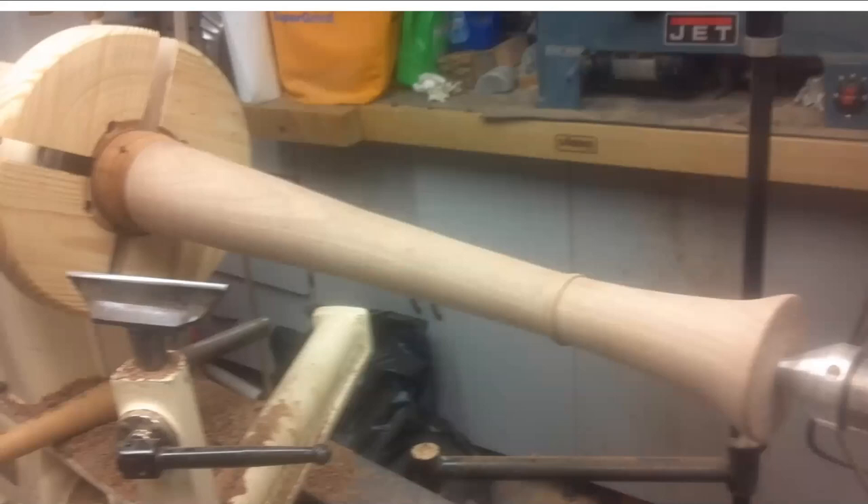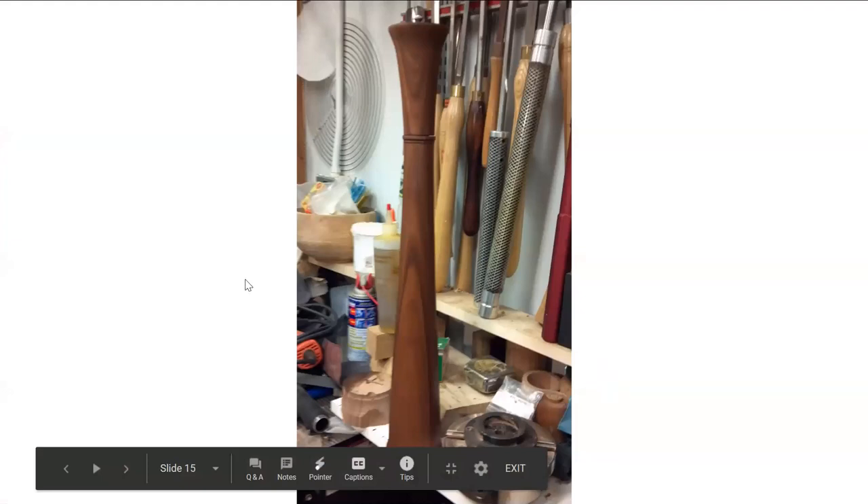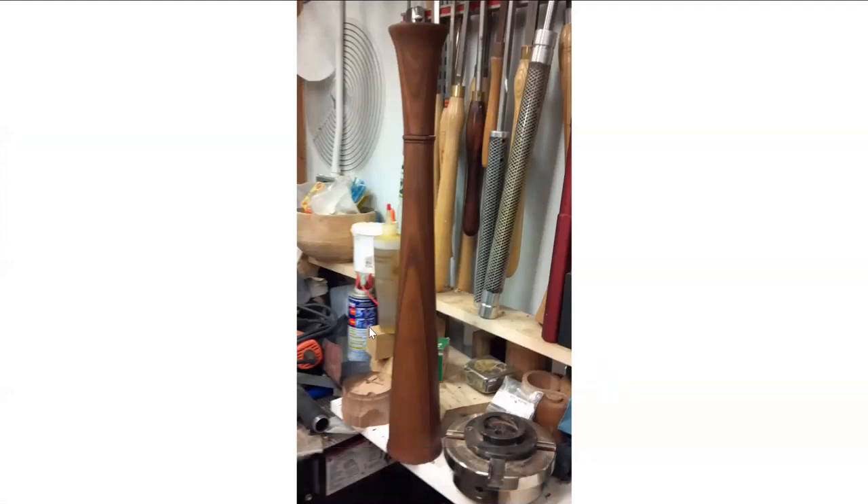The bottom section was drilled and the depth was marked on the blank every inch. Both bottom and top were combined and turned to finish the piece. That was the result of the storyboarding — I didn't chance creating this one-of-a-kind item freehand. The storyboard method ensured a fairly accurate rendition of the drawing. The long, gradual curve was too challenging for me freehand. The manual storyboard method was a good assist. Please note the custom-made chuck jaws — we'll see more of them later. Here's the finished pepper mill.